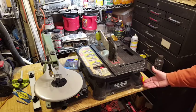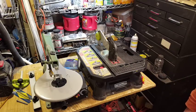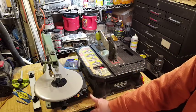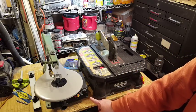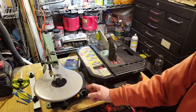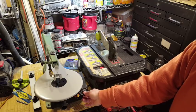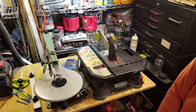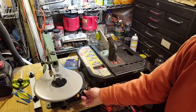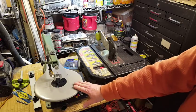The Blade Runner runs at one fixed speed — that's it. The scroll saw, on the other hand, is variable speed. With the speed control rotated all the way counter-clockwise, the slowest speed is about 400 strokes per minute. At maximum speed it's about 1600 strokes per minute. So we've got fixed speed versus variable speed.